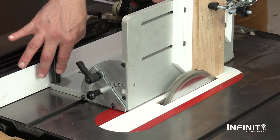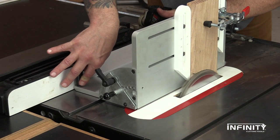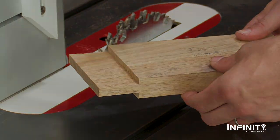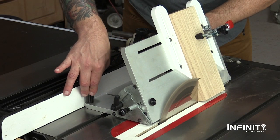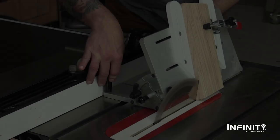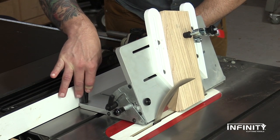With the vertical fence at 90 degrees and the workpiece clamped safely in the fence's clamping bars, you can easily run an oversized tenon on the table saw. Tip the fence to 33.3 degrees and you can safely cut a miter impossible on a miter saw. Change the angle on the fence's clamping bars and a tapered miter is seconds away.